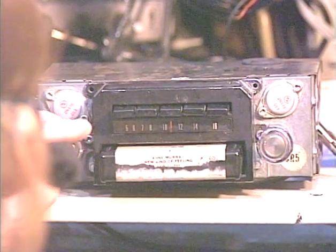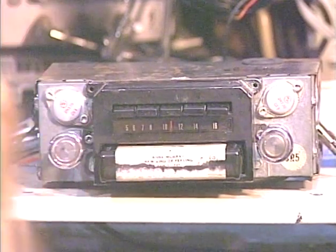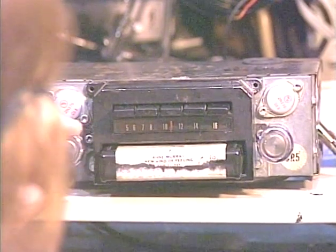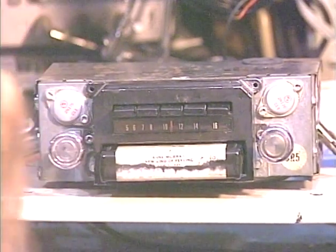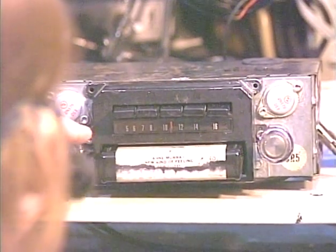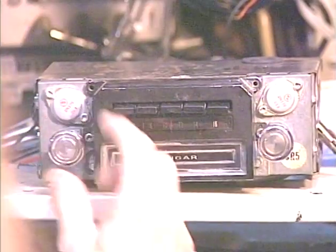So unless the customer is willing to buy a new board, I'm not willing to add more voltage to it. Normally, when you plug a tape in, it sends 12 volts to the board to activate the aux input. I'm not going to do that on this radio. The customer just has to live with the fact that it's going to take 20 seconds for the radio to